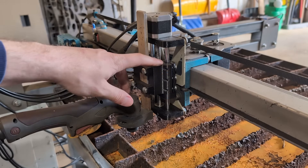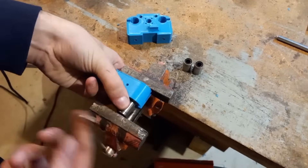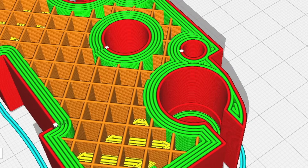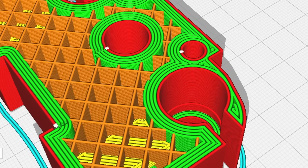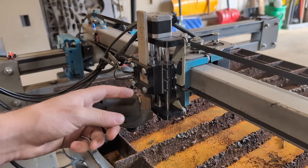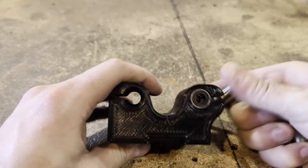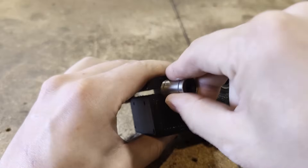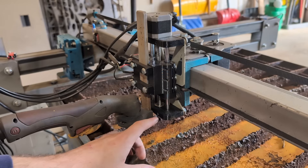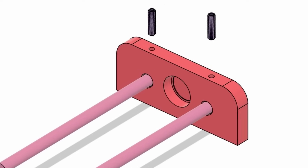On the old design, we opted to go with a press fit for the linear bearings, and that press fit design also had retaining rings. The retaining rings were kind of hard to print if you had a smaller nozzle size, and they were just not the easiest to install or disassemble. So we moved to using screws to clamp the bearings into place, much like the XL. We also added set screws to hold the linear rods into place.